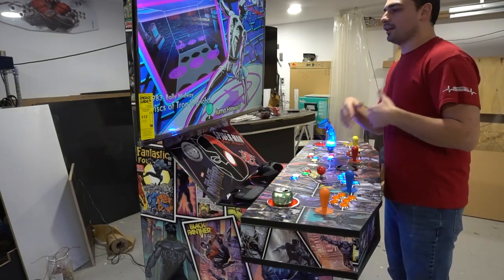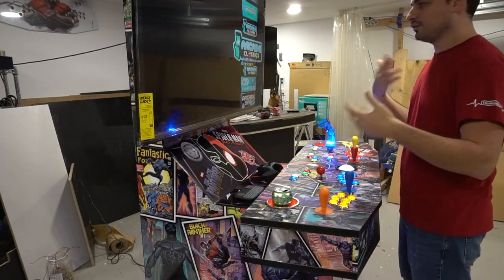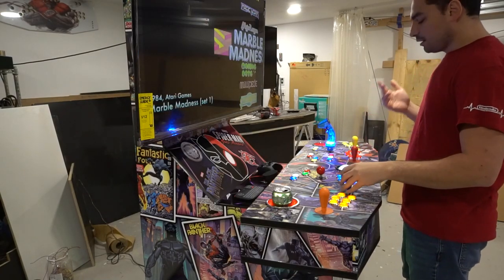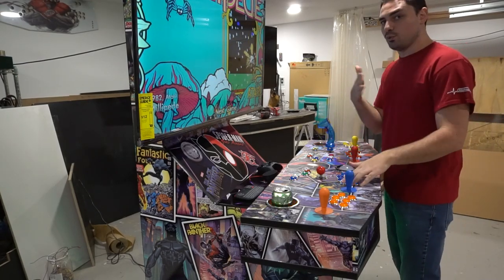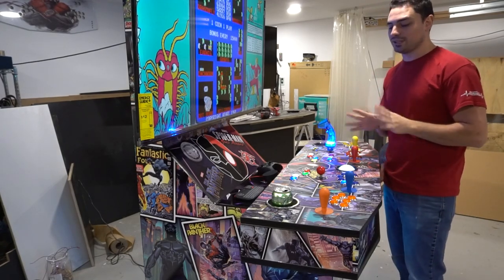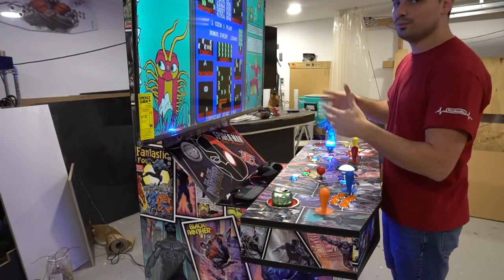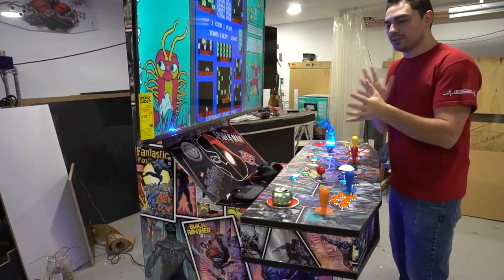Now again, I'm going to talk about the LED blinky, because I do get this question a lot. If you see Project Canada's video, it was the first time I used LED blinky and I had my personal opinions on it. What do I want to say? For LED blinky, I use the LED Wiz. I do not like I-PACs. If you see my videos in the past, I don't deal with I-PACs. LED Wiz has 32 outputs, and as you can see, there are more than 32 buttons on this. So I kind of manipulate and use the LED Wiz accordingly.